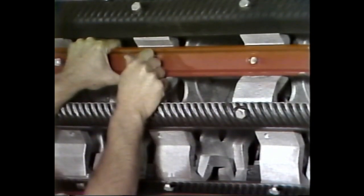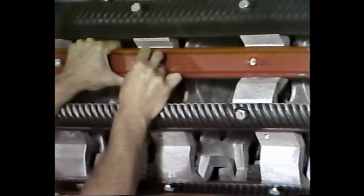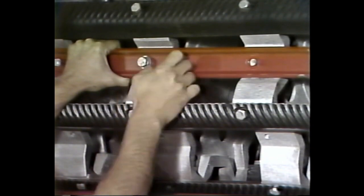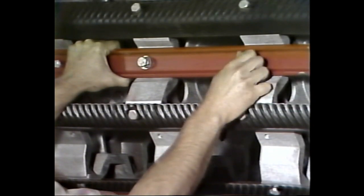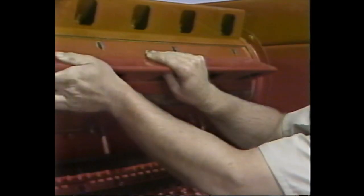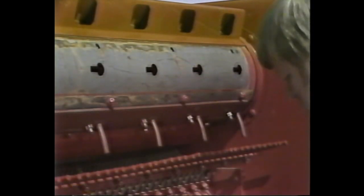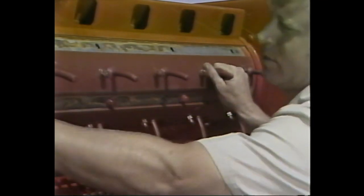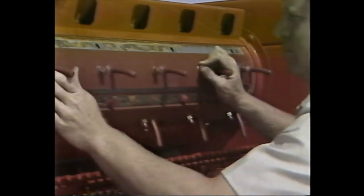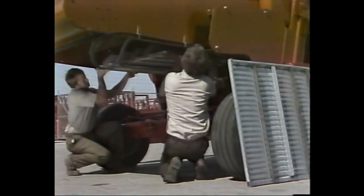Once the cylinders are in place, install the threshing cylinder filler bars. Bolt each of the 8 bars provided between the rasp bars on the cylinder spiders. Secure with 1/2 inch by 1 inch bolts, flat washers, and lock washers using the holes in the spiders. Continue the corn kit installation by removing the vane-type bars on the rear beater drum and attaching the rear beater spikes in their place. Each set of 3 bars must be installed in alternate order on the drum, with the spikes trailing in the direction of the drum rotation.